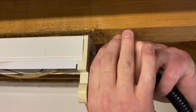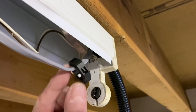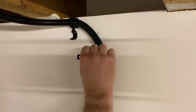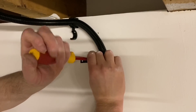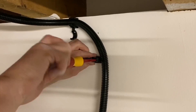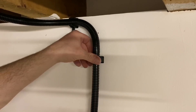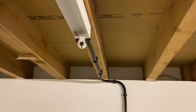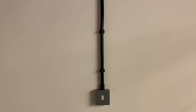Then introduce the lock nut and tighten it up. Now the favourite bit - the clips. The interesting thing about these clips is they're the same whether you're using the regular Flexicon conduit or this slit system - you don't need to carry different clip types. They really do hold firmly. It will look a little flexible when installed on the surface, but it's straight and looks a lot better than before, and you've got that mechanical protection.